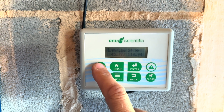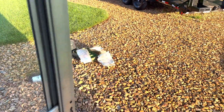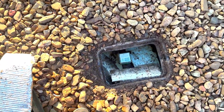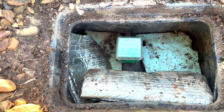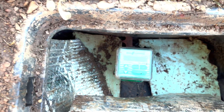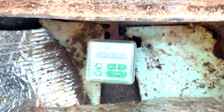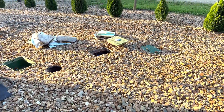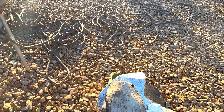Running at six and a half hours at one time — so we'll walk out here. This is the actual well. It's an old well, drilled in 1964. The casing doesn't stick up out of the ground; it's actually recessed in there. I have the Well Watch hooked to the well seal. This well makes about 75 gallons a minute.